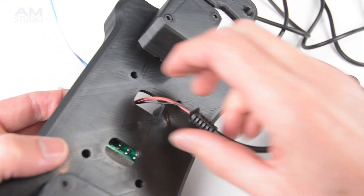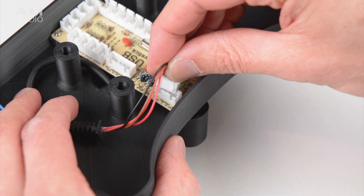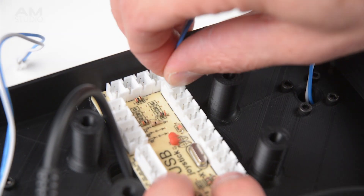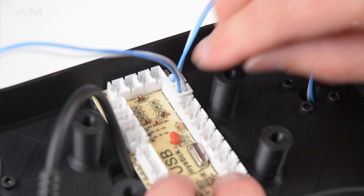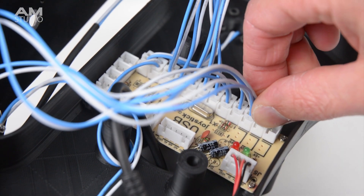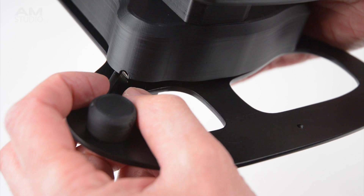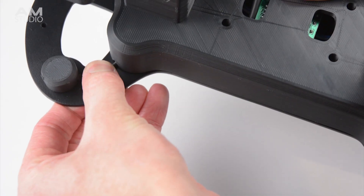The USB connection is passed through a hole on the back and into the inside of the enclosure. Then the cable is plugged into the correct socket on the joystick board. The two cables from the shifters are also plugged in, then all the remaining wires from the buttons are plugged into the joystick board. With all the wires connected inside, the front plate and the enclosure can be aligned together. Check the two top button wires with the heat shrink are aligned to the slots on the enclosure before completely closing.